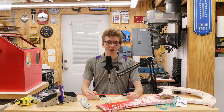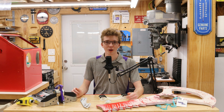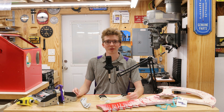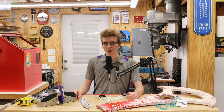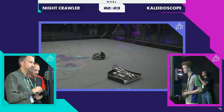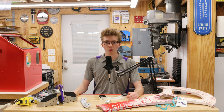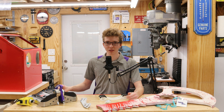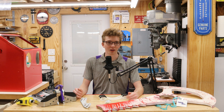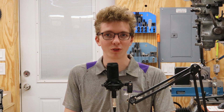That fight was pretty disappointing. That fight could have gone a lot better for us, but as soon as I walked my way out to the middle of the arena, it was very obvious that the bot was not going to be fast enough. It held up pretty well considering all the hits that were taken — I didn't get tossed very far, even with really good hits. So the weight was definitely playing a role. But very early on in the match, I took a really bad hit to the billet that ended up bending the side in almost an inch and seizing that side of the walking mechanism.